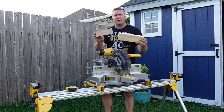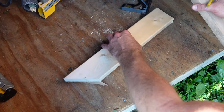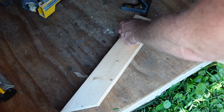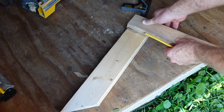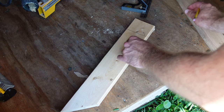Alright, now I've got the 2⅝ and the 3½ inch boards. So this is what we do: you take this piece, set it on top, flush it up with the back and the side, and you mark a line. Pull it up and just make yourself a little arrow, because that's the way you're going to trace to that corner.